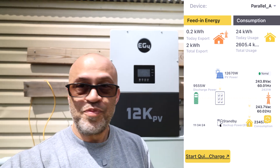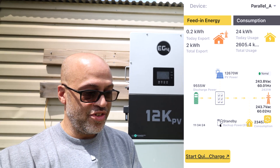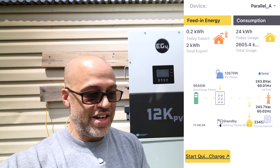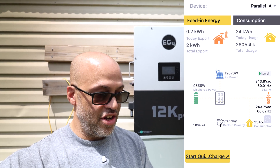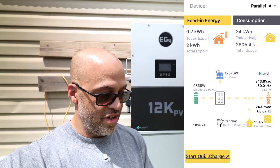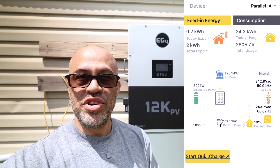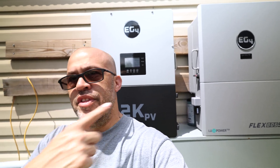It's rated for 21,000 watts with solar and grid combined, so it's definitely over that — but it's doing exactly what it's supposed to be doing. We've got 23,457 watts coming out of these inverters with only 2,431 watts coming from the grid, so about 21,000 watts is coming from the inverters themselves. With grid assistance, these inverters are able to run over their rated power — doing exactly what you want the grid boss to do: pull just enough power to keep these maxed out and keep everything in the house running.